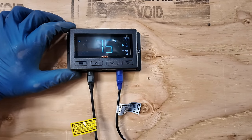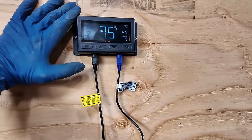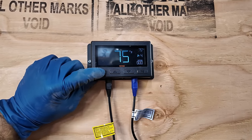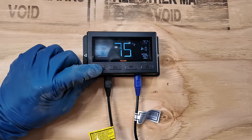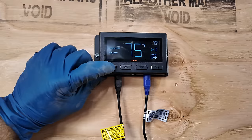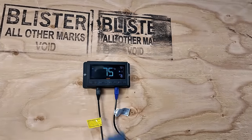Along with the thermostat, there are lots of things you can do. This thermostat is powered by the fan, so if you unplug this, it turns off — no batteries involved. Right now we're on 'on.' There's also an 'off,' a timer so you can set it to run for so long, and automatic mode for high temp, low temp, high humidity, and low humidity. There's also an alarm setting for high temp, low temp, and high humidity. I just have it on right now and I've been running it full blast because I want to see how it works in here.